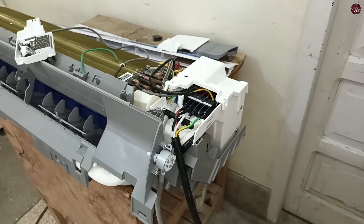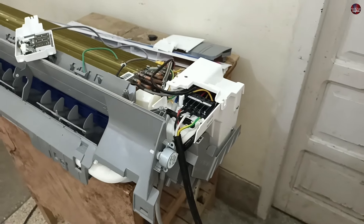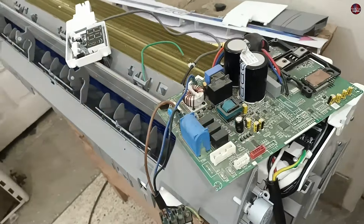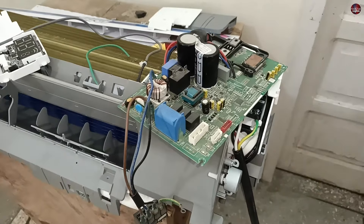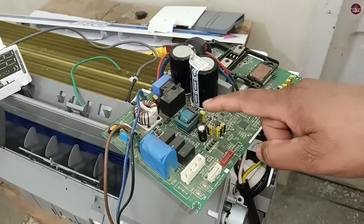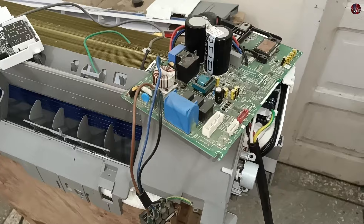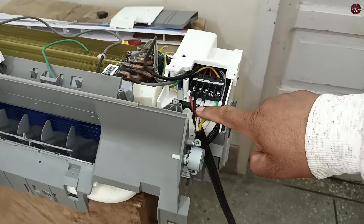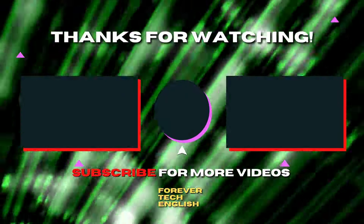If the electricity is passing but the communication system on the outdoor unit is not working fine, this means that the wire is bad, or the circuit board installed in the outdoor unit is bad. You will see a circuit board by opening the outdoor unit cover. Check the circuit board because if the fuse installed in it is blown, the circuit board will not work and the error code will be shown on the display. If any other major component, like a switching IC or the SMPS circuit, goes bad, this EL01 error code will still be displayed, and you will need to repair the circuit board. Check the wire attached to your air conditioner thoroughly. I have a playlist of AC repair videos — click on the thumbnail to watch our next videos, and subscribe. Thank you.